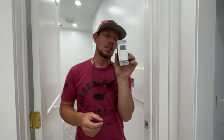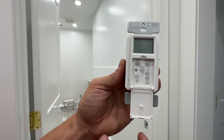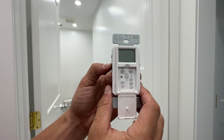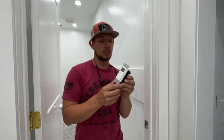This is the next switch I want to talk about. These ones are what we call a sunset timer switch, and they can be three-way if you want. This one is, but I'm not going to be using it as a three-way switch — just a one-way switch is how I'm going to wire this one, but the option's nice. What's cool about this one is all of that information on the inside. This is programmable and it's built with programs already in it. Based off the time zone of where you live, it knows that information, and you choose that, and then it can be a switch to either turn on at dusk or dawn, or whatever schedule you want to put it on.